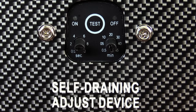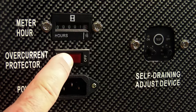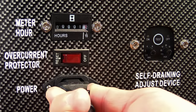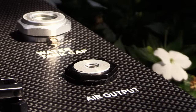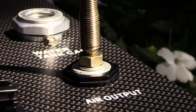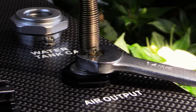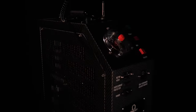The longer and more frequent the moisture purge, the more time your tank will take to refill. But I want dry air in my guns at all times. Make sure the overcurrent protector switch is in the reset position, then plug in the included power cord to your supercharger and to any 110-volt outlet. Grab the included air hose and make sure the blue dowty seal is on the end. Snug it down with a 14mm wrench — don't over-tighten. Now your Omega Supercharger is ready to go.